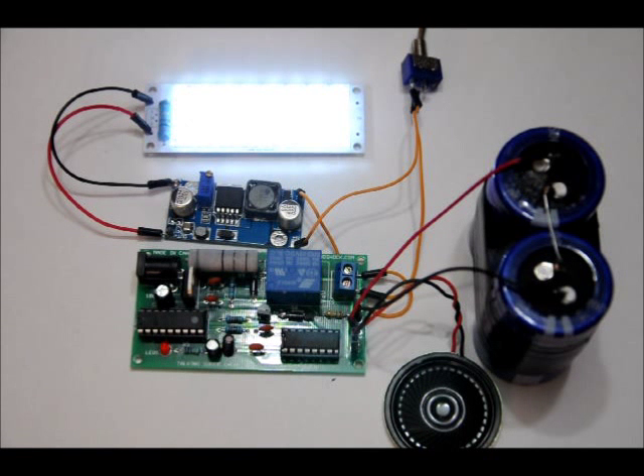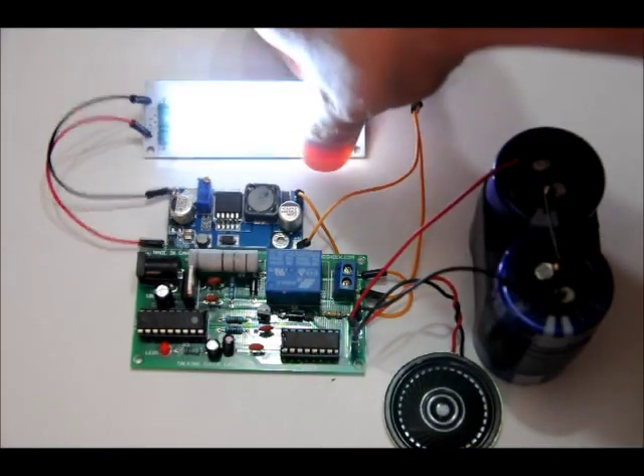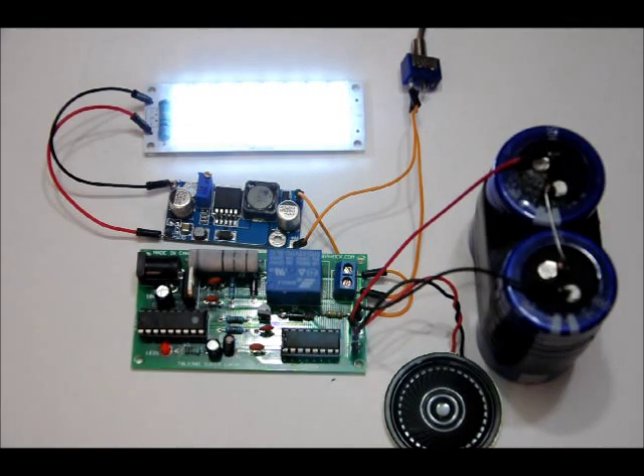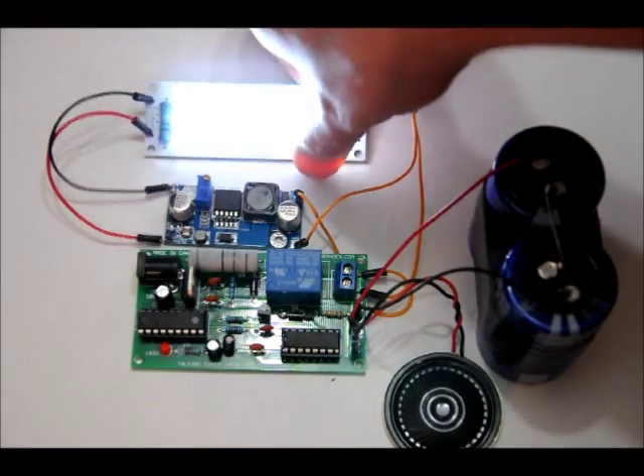I've got a little bit of work to do on the software, but I could probably finish it up in 5 or 10 minutes — I spent my Sunday afternoon working on it. I easily get 30 to 40 minutes of charge based on a fully charged set of capacitors. From 0 volts to 5.2 volts, it takes about an hour to charge. The booster cuts out at about 3 volts, so a charge between 3 volts and 5.2 volts only takes about 15 to 20 minutes, and you get 30 to 40 minutes of light out of it per use.